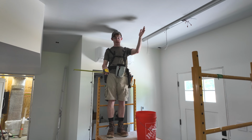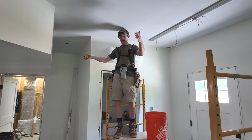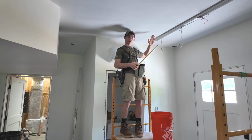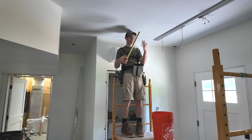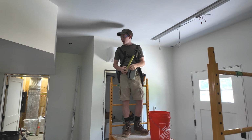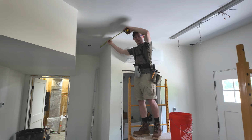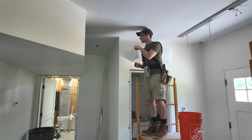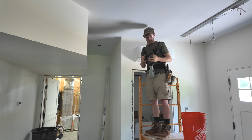So the plan here is 2 8 foots and a 4 foot, so a 20 foot run. And this one, because we have this little alcove back here, I was gonna do just 3 8-foot, so a 24-foot run. So I really just need to make sure that I start these lights exactly 4 foot offset from one another, so at the garage door end, they don't have some weird staggering effect and they look like they end at the same spot. So from this wall, this light is 12.5 inches. So we just need to make sure that from the same wall, this light starts 4 foot minus 12.5 inches, so just under 3 foot. So we may need to drill our own new knockout for the wires on this one. And same thing with the mounting screws, we're gonna have to figure out where the studs are at. But yeah, that's the only little tricky part about this back garage.